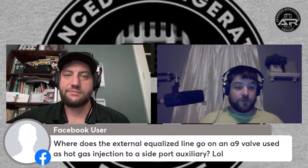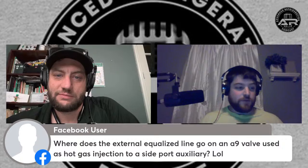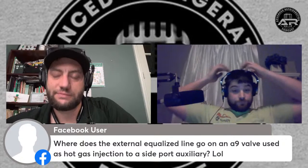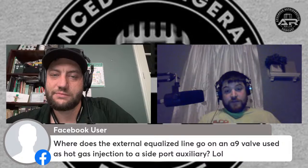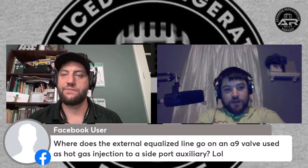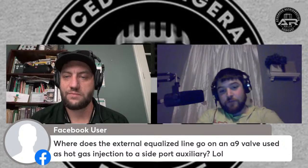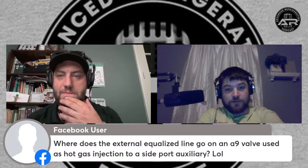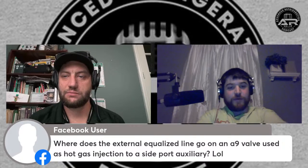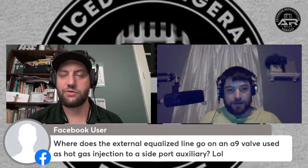Or else they... go ahead. So these things are running like the Bezos build, right? Yeah, you broke up. I said they're running like the Bezos build. Yeah, no, 100%. Same exact issues. They're running like a 65-degree saturated condensing temperature, and it's been nothing but issues because the compressors are way oversized now, and in the wintertime they're short cycling. So every one of these we set with a standard set of gauges, we're back there a day or 2 later, as soon as the freezer comes down to temp, and it's just banging on and off. So you pretty much can't set these without a digital gauge. It has to be almost exact, like a 1 pound, 1.5 pound cutout.